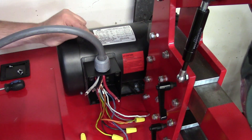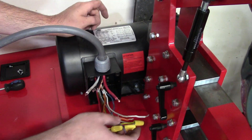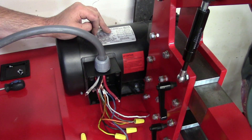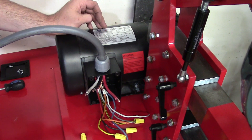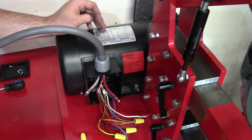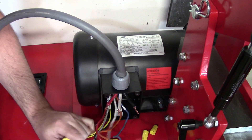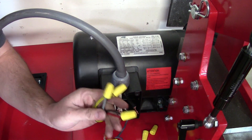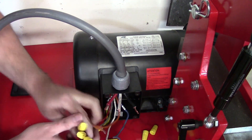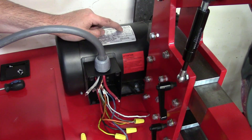The nameplate has your wiring schematics. This one has lots of wires because it's a dual voltage motor, which means it could be wired for 120 volts or 230 volts — 230 volts is what we're going to use to run the VFD. You need to combine certain wire pairs. I'm not being specific about wire colors because every motor is different — you'll need to follow the description on your nameplate. All the wires are color-coded and labeled.